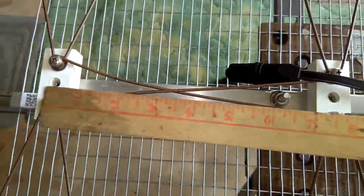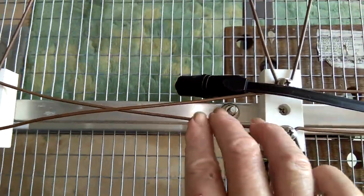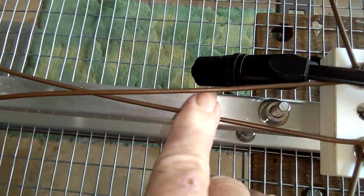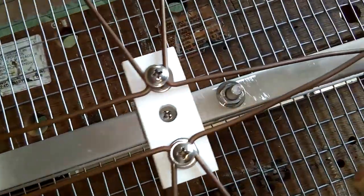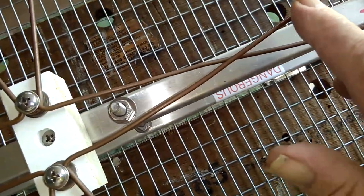The center feed point is four and a half inches from the base — that's your base spacing. The phase lines cross at the bottom; you need a separation, usually just enough to get your finger through there. There's also a cross at the top — this is cross-phasing, and it's very important.